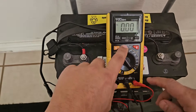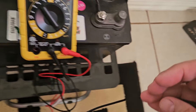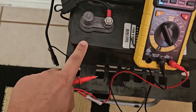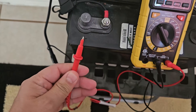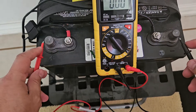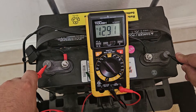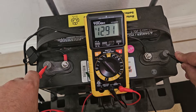So what we're going to do — remember we already put it on 12 volts, it's not in the off position anymore — we're going to touch the terminals. It's color-coded: you can see there's a plus sign on the battery, the red is the positive one, and here we have the negative pole. You just touch both ends and we see that we have 12.91 volts.